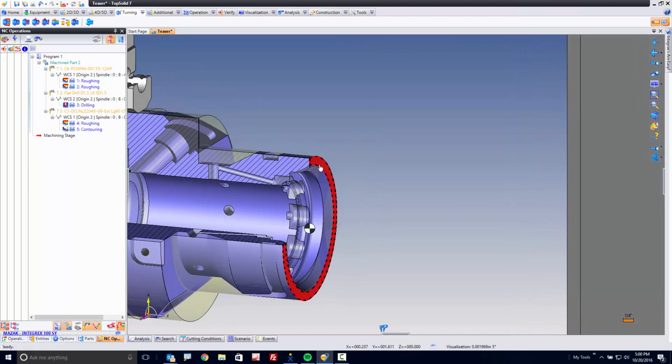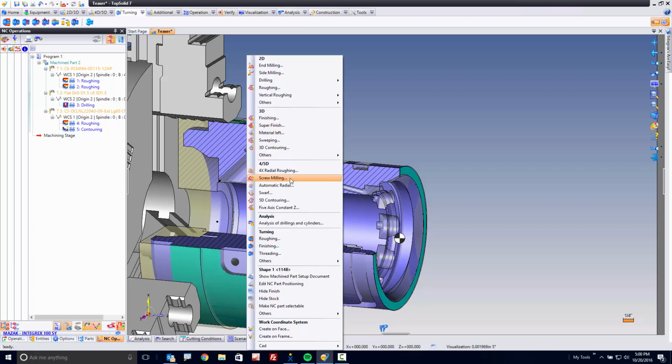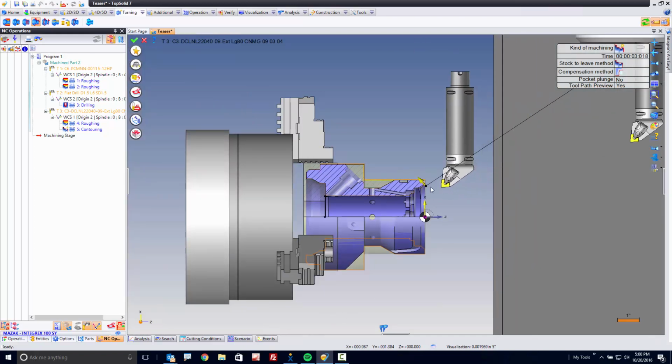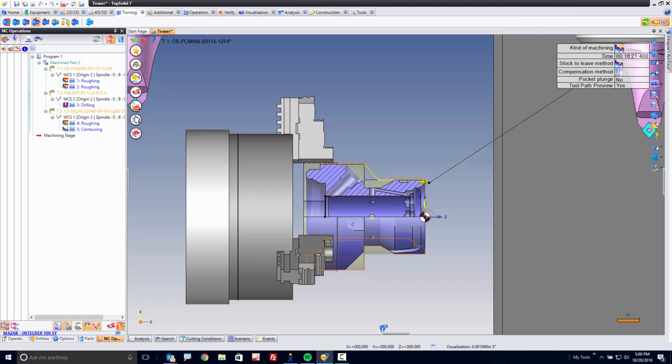After that, what I want to do is finish turn the outside. So I'm going to rotate this a little bit, select this face, and maybe I'm going to finish turn up to here. Okay, so let's go here and we'll go to finishing. Now, in this case, I could, of course, use this tool. You can see it oriented it vertical, and technically, maybe it would work, but that tool's sticking out a far way, so I'm going to tool change, go back to my neutral tool,